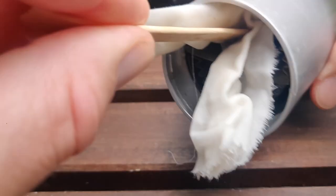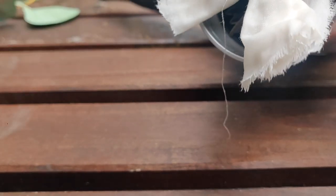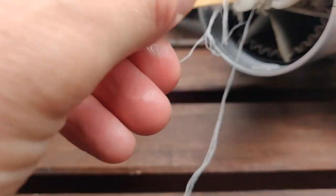So how does a glycerin smoke machine actually work? What happens is it's heated but it's also atomized, because air is flowing over the rags with the glycerin on them. That brings with it a little bit of the material, and that is the material that gets heated and turns into smoke.